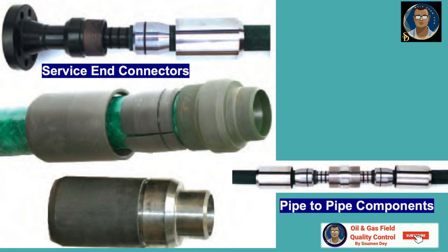Connector forces are typically applied through wedge loading of a slip between two body hubs. The effect of internal pressure and temperature changes on axial forces in the RTP line pipe must be taken into account when making up fittings. In preparing for attachment to another system or fittings, the needs of the customer and system must be considered and the proper end configurations ordered. Planning should consider the application and connection means to be used, as the assembly procedure may vary slightly depending upon the type of end connection involved.